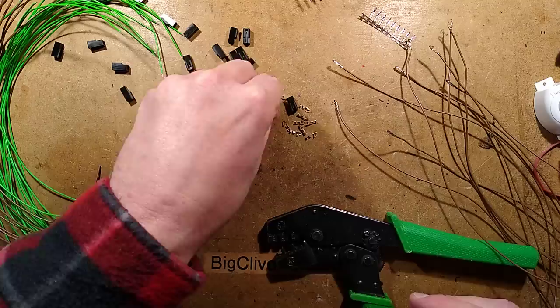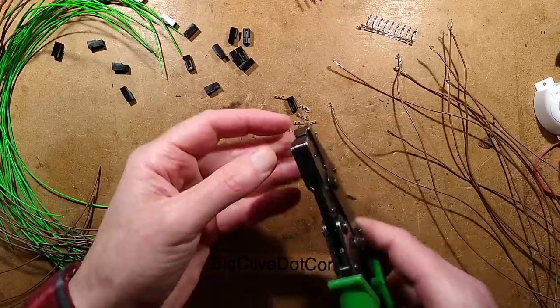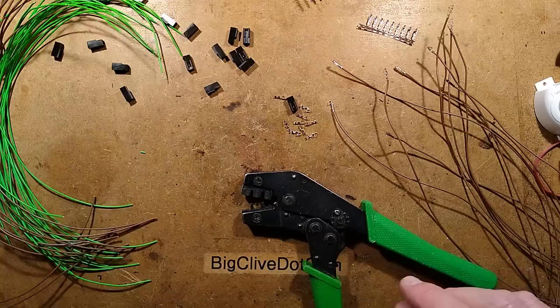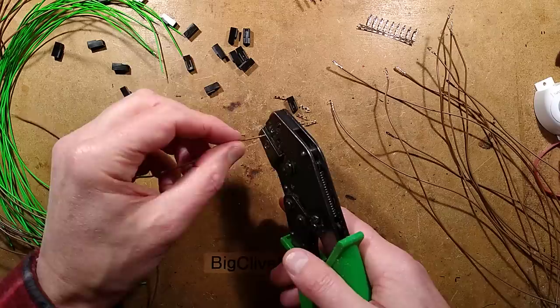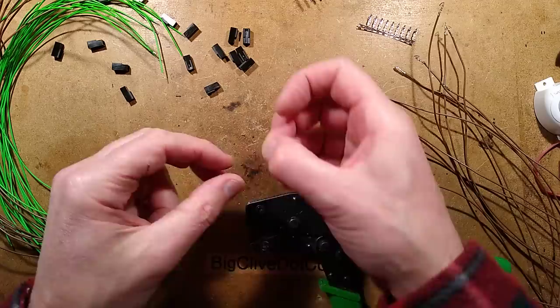Next question. Dystopian Paradise asks: first major shock and most pleasurable. My first major shock — I've often mentioned this — was in a supermarket on an automatic barrier gate that had been serviced by someone who wasn't very competent. They'd missed off the nylon spacers that separated the circuit board from the metal case, and also the brass spacer that earthed the metal case from the circuit board. So the case was unearthed. As I pulled the control module out, the circuit board got pulled against the case and I was given a full, hand-to-hand across-the-chest whomp electric shock. Trying to maintain your dignity when that happens is really not fun.